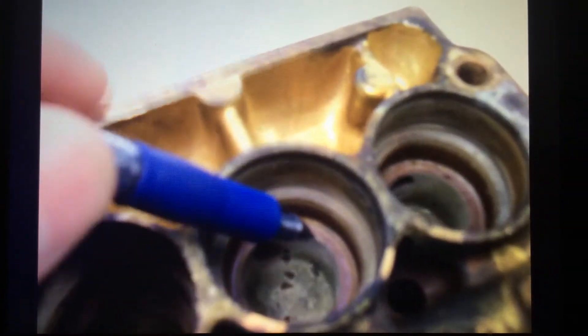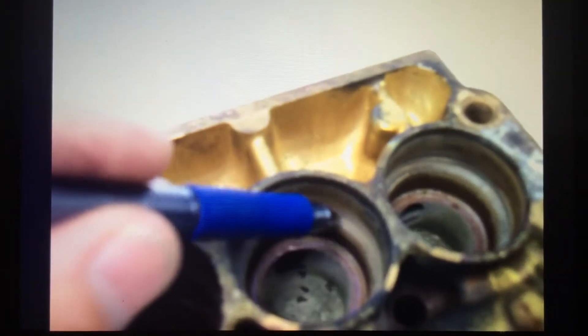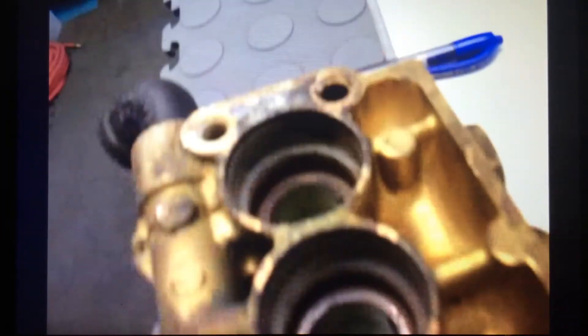So we do a complete check on all three cylinders of this vertical surface that goes up and down right here — that's your high-pressure side. A little bit higher in the head, this is where the low-pressure seal retainer is at, but down here on this shoulder, very critical. So we check all the way around — we inspect it with a flashlight while it's out.